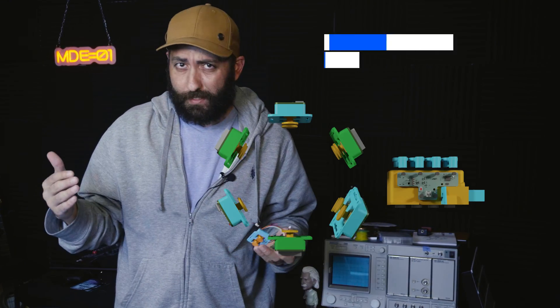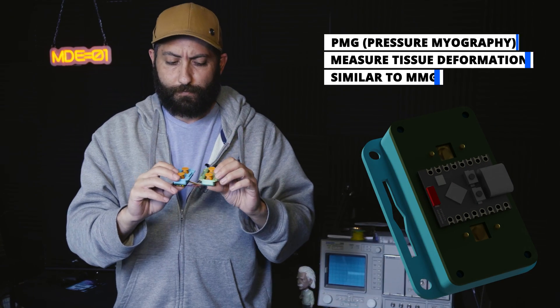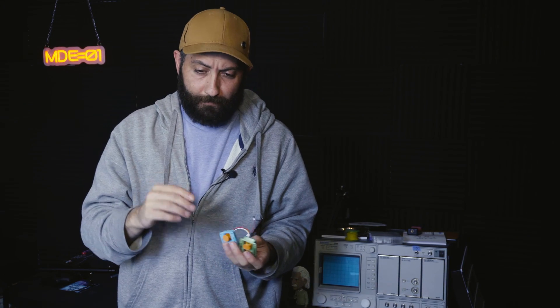Where we're at in the process: we've successfully measured the muscle contractions with a custom pressure sensor, and I'm calling these PMG for pressure myography. MMGs are very similar — they're low frequency mechanical myography devices. There are some fancy words there, but essentially they're looking for the mechanical vibrations that stem from the muscle contracting.